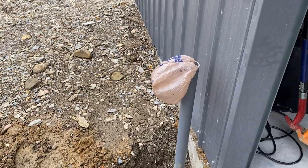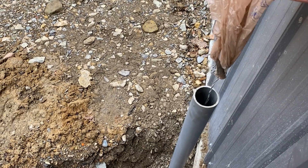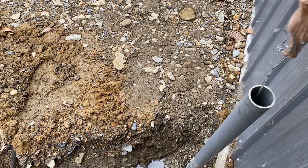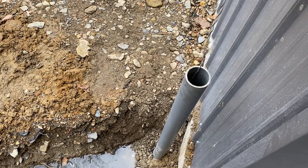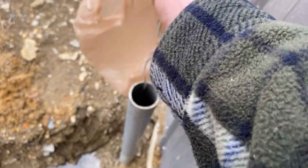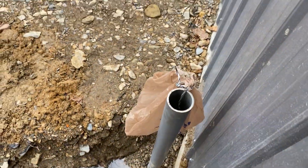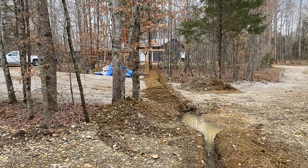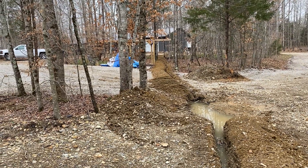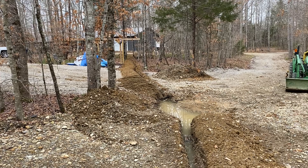There's the plastic bag we stuffed in, now at the other end. As soon as it popped out, the line stopped blowing through, so there's really no chance of blowing a bunch of excess through — especially on a run that's a couple hundred feet long. There's some resistance on that string; I can feel it pulling back on me. It's not a perfectly straight line because I cut through the trees, so it weaves a bit. Now I'll tie my yellow heavy line onto it and get my electric hook, and we're nearly done.